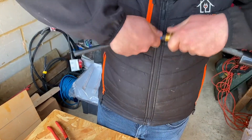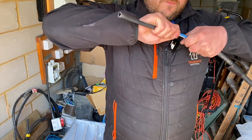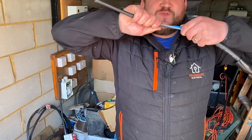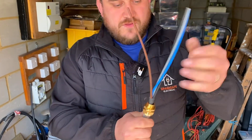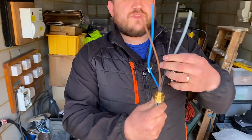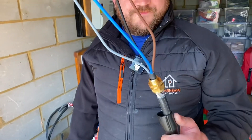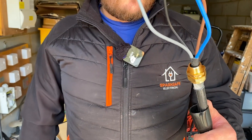There we go. The last little bit of that bedding material is always something that's going to be awkward. You're twisting with the way the cables are twisting as well. And there are our conductors - we've got our three lines: brown, black, grey, and our blue neutral conductor, because the armour itself is providing our protective conductor. Which is quite common in an industrial setting. And if you want to see the parts of a CW gland, we used a BW1 - check out the video on screen now.